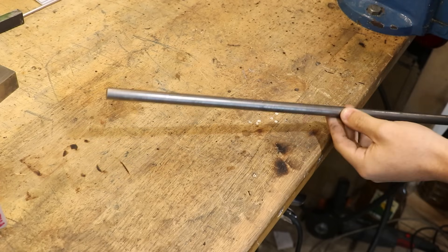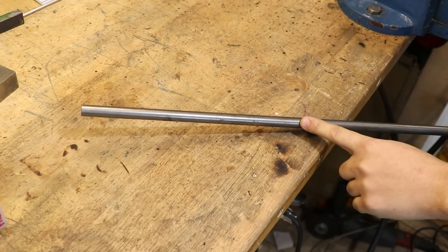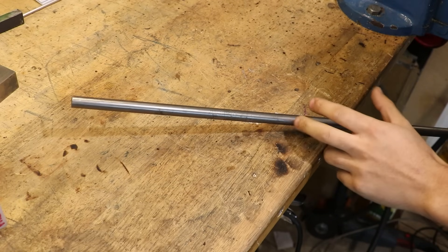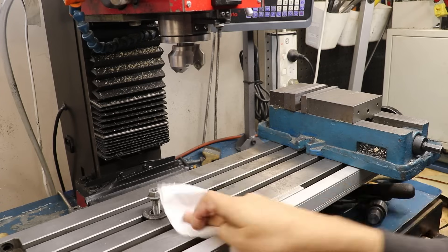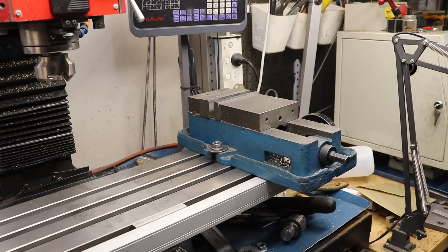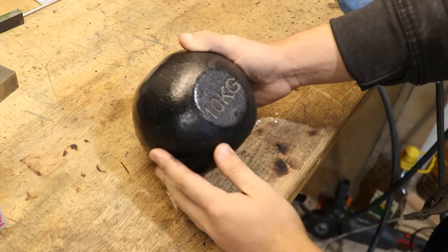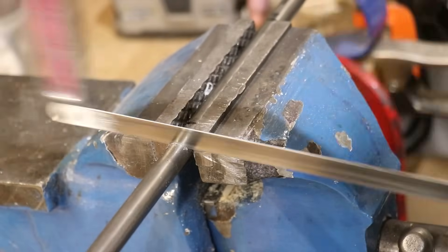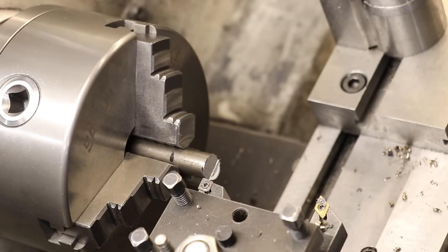But at this point, even if you still don't believe me, let's try it out for real. What I have here is a piece of 1045 round bar — it's medium tensile steel and medium carbon, and I should be able to heat treat it to the high 50s Rockwell C hardness. But as it is at the moment, it's not hardened beyond a little bit of work hardening, which really won't affect it. Now in order to test this, I'll set up a test bench on the mill. I'll move the vice to the far end, which will allow me to clamp in a long piece of steel. To act as our bending force, I've taken the weight off the back of the fly press. I've drilled a hole through it and removed the handles, so the weight comes out to just under 9 kilos. The hole that I drilled was 12mm and the stock I'm using is half an inch, so the first thing I need to do is turn the end down to make a step.